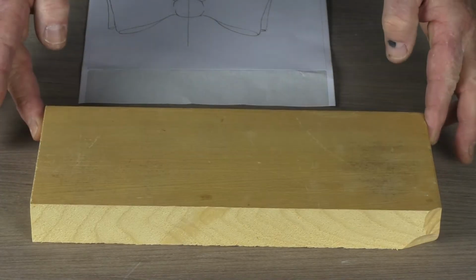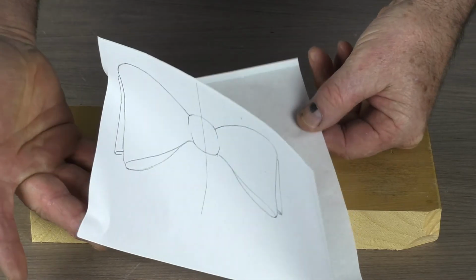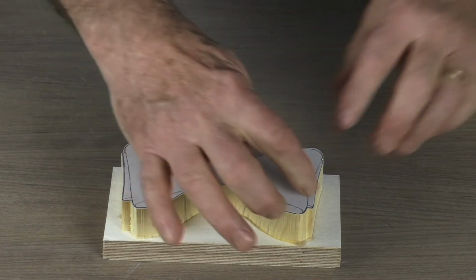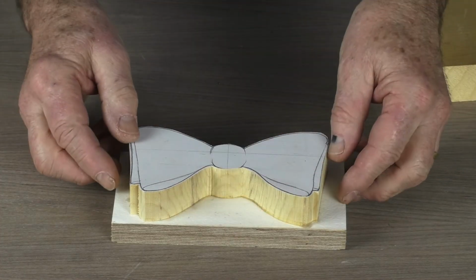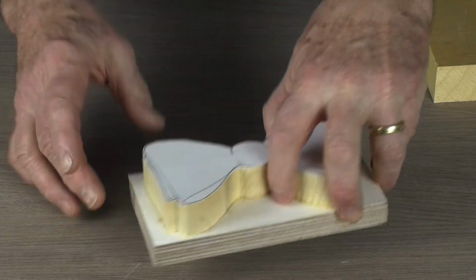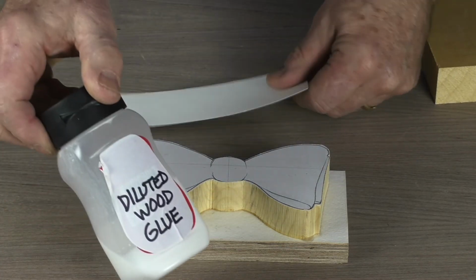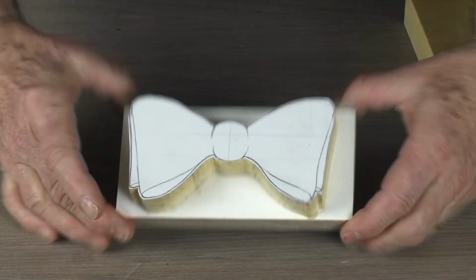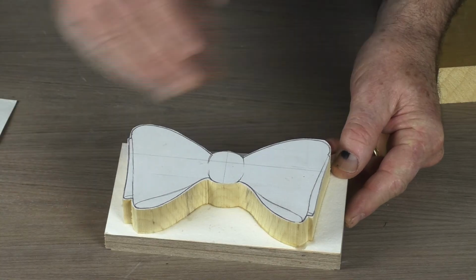So I'd have my piece of wood. I've got my working drawing, and in this case I've printed it onto a label, scanned it in, printed it out on a label. I stuck it onto another piece of this wood, which I cut out on the bandsaw. This is a lot thicker than I want, I think, but it's better to have more wood than less. And I've glued it down to a piece of plywood, which I'll hold in a vise, with some watercolour paper, quite thick paper, and diluted glue. This is called the paper sandwich, and I'll put a link below this video where you can see more about that. So here it is, my carving ready to go. I've got my model, got my thoughts and my drawings ready to go.